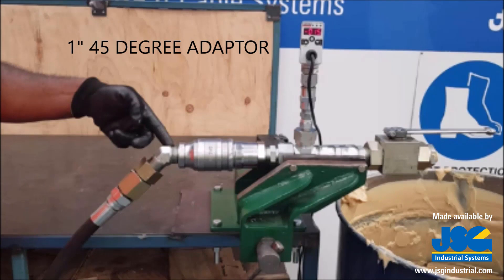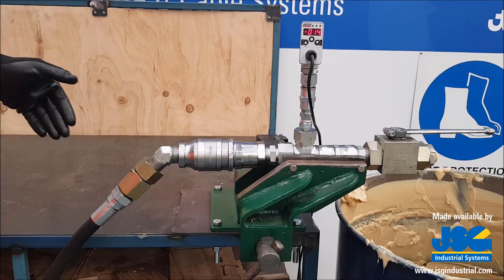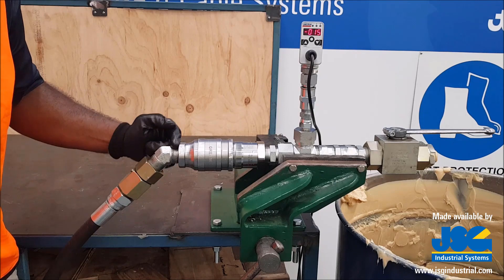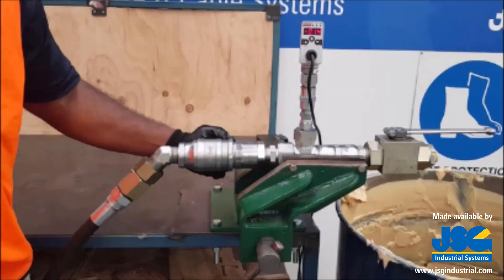After the swivel it is then connected to a 45 degree adapter, which plays an important role as not everyone uses this hose size and there can be many additional fittings to adapt to the grease coupler. Without the 45 degree adapter, if all the additional fittings were lined up straight, it will add an additional lateral bending moment force on the coupler, which will damage both the nozzle and the receiver.